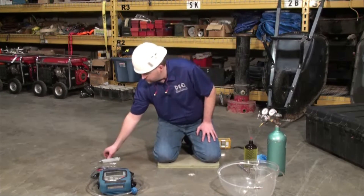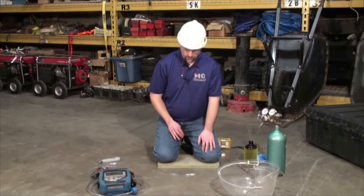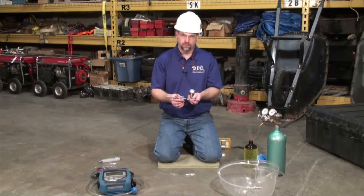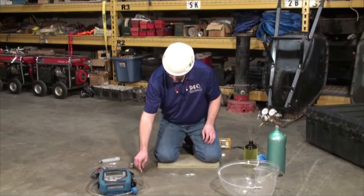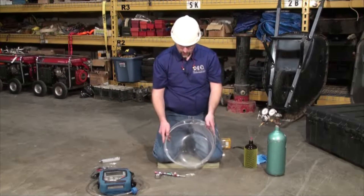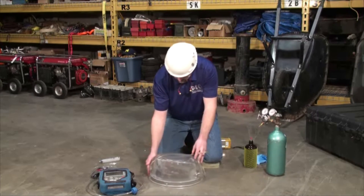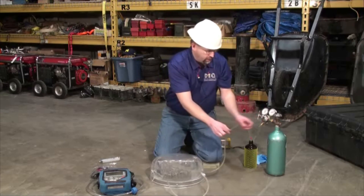After I do that, I hook up quarter inch Tygon tubing directly to the well. I then hook up my soil gas regulator — these come in many shapes and sizes depending on your lab and where you get your supplies. This is my helium chamber. It hooks directly to the soil gas regulator and then gets placed over the hole, and this line goes to the helium.